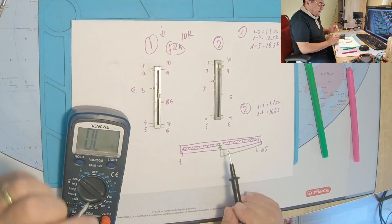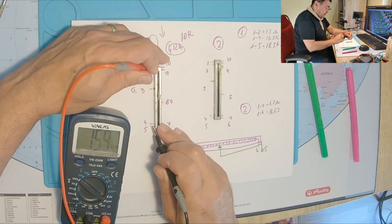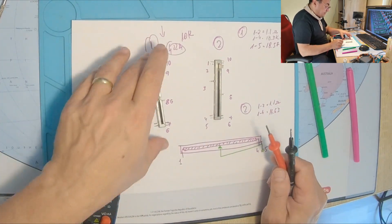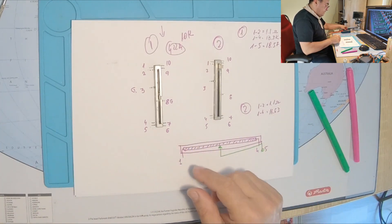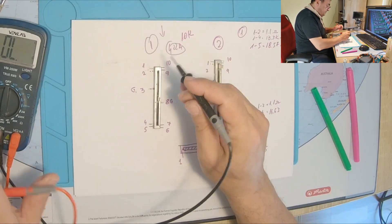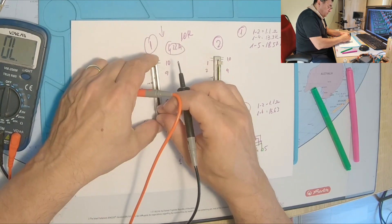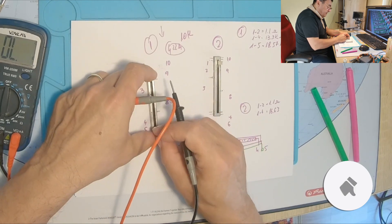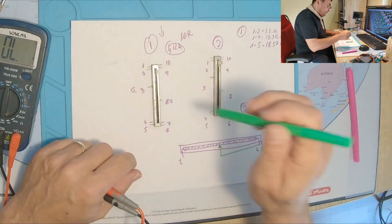Anyway, the most important connection here is pin 1 with pin 5 — that's for sure, because we have a clear varying value there. What's happening with pin 2 is still a mystery. At first it looks like 1.1 ohms with pin 1; if I move the slider it goes to 0.7 — almost a short. So pins 1 and 2 appear to be tied together.